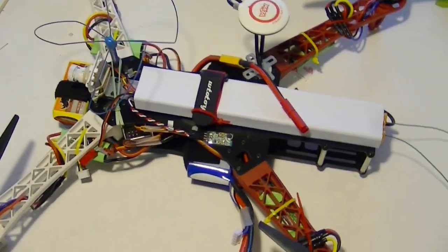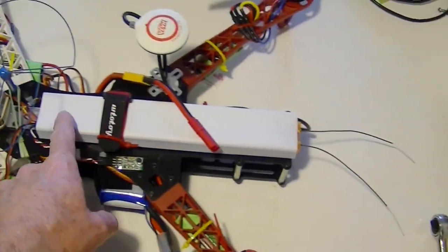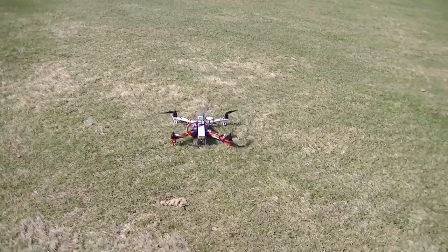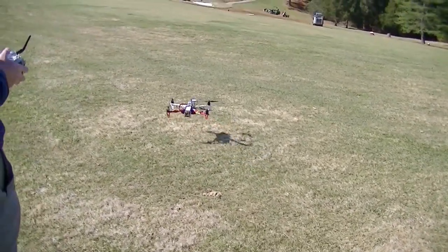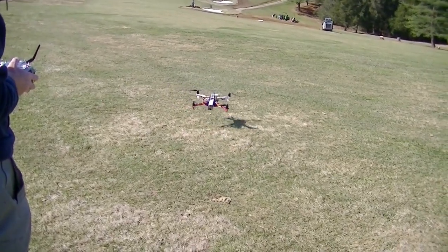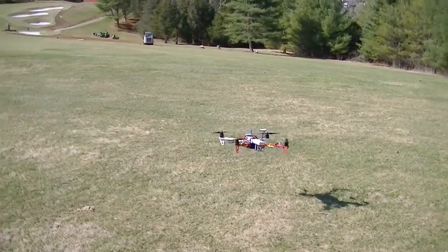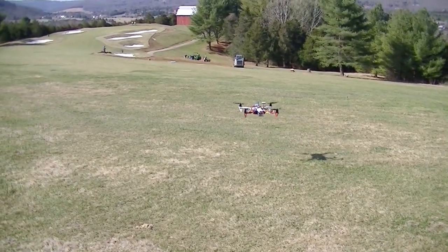During this first clip I want you to look at the gyrations that happen while I'm flying the quadcopter. I later found out this was caused by the gains, or the basic gains, being set too high for the DJI NAZA M lite. We have a lift off — it's a little twitchy though. It's toilet bowling a little bit there.